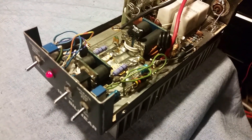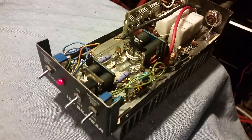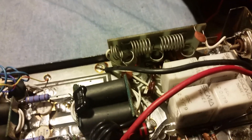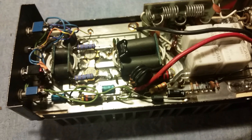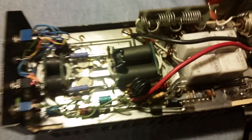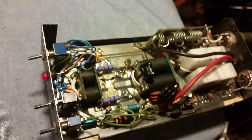All right, here you have the 100 Bilinear. Let me explain something about this amp, which I do know because I've owned this exact amp before — I got rid of it not too long ago, maybe half a year ago. This amplifier does not do a lot of watts like the other two. The reason, in my personal belief, is this amplifier was designed to be as wide-banded as it possibly could be. Those coils on the output are an attempt to make this amp work as well as possible on the whole HF spectrum, so it's more designed to make watts on multiple bands.